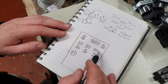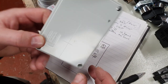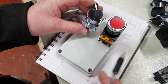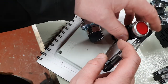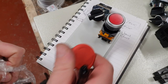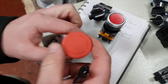Over at the tank you don't want to be walking backwards and forwards to the control panel all the time, so we're going to incorporate a little IP65 project box beside every single tank. That will house a manual override so you can turn the pump on and off regardless of the timer state, a start button for the timer, and just in case somebody hits the timer switch accidentally, each one will have its own little emergency stop button so you can just stop it, wait till the time has run down, then reset and away you go again.